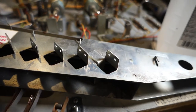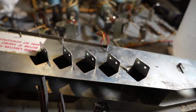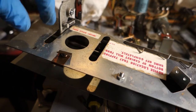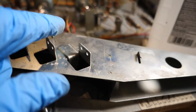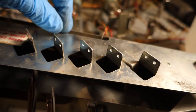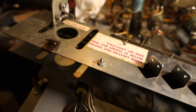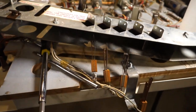These are the switches — based on what I can tell. I don't have the schematic or manual for this game, but from what I've read, it probably uses one ball, which makes sense because it says 'insert the ball' here and that's the end of the line for it. What I figure happens is the ball comes in and it does various things to end the game — bring down the ball count, add up scores, check stuff. Plus there's a switch at the very end so the game knows a ball is ready to go. Hopefully it'll work without me having to get the schematics, but if I do, that's okay.